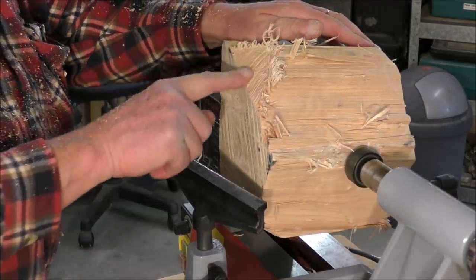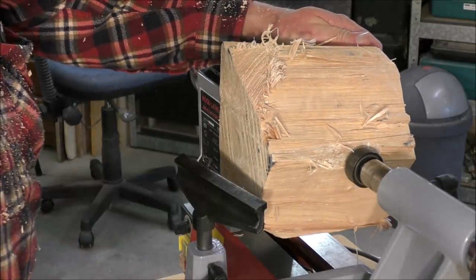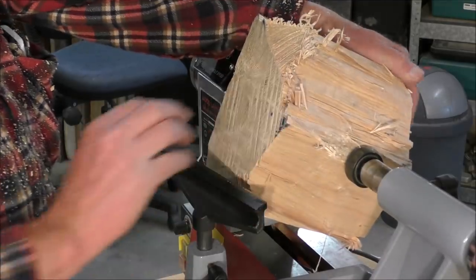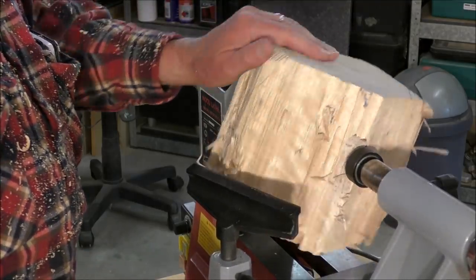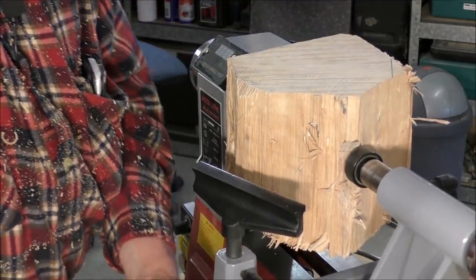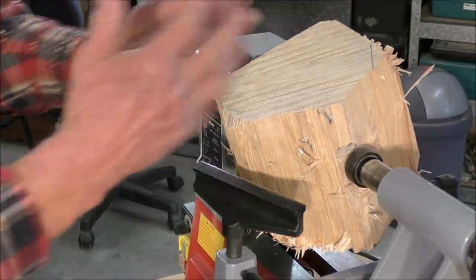You can see we've started to remove some of the highest peaks now. And as we machine down into the material a bit further, we should stop a lot of the rocking motion. In fact, if I start down here and take that out a bit, because a lot of the weight is there. So we'll just move over down here a bit. There we go. Tighten that up there. So I'll gradually just machine this away, and it will stop all this rocking around.